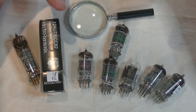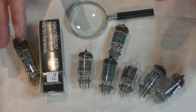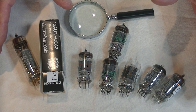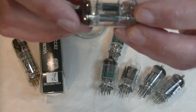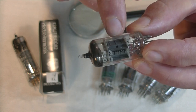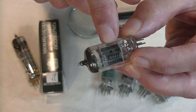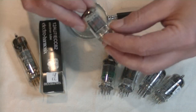So how do we verify that we've got a Mullard? One way is to go to a known Mullard and just compare them. I don't have a 12AU7 Mullard, but I do have a 12AX7 Mullard. One of the things to watch out for — let's see if we can get it up close — is on the side of the plate you see that round hole. It's fairly large, even for a small signal tube. That is a good indicator that it might be a Mullard. Other manufacturers use those holes, but they're actually quite infrequent, and on small signal tubes Mullard used them a lot. So there's a good hint.